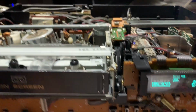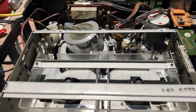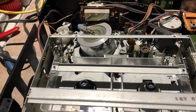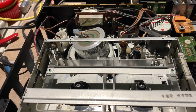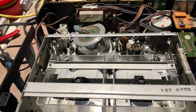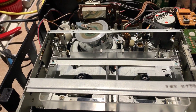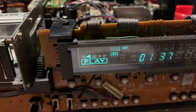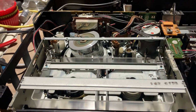I already tested this prior to. Everything's nice and strong. This is your fast forward search. And that tube's nice and strong. Rewind search. Oh, I hit stop instead. Well, there's your stop. Here's play again. Now, here's rewind search, with the reverse blinking play light. Now, because the other reel's not turning, it thinks there's a fault. So it just, see, it's blinking there.